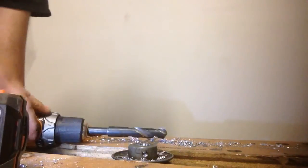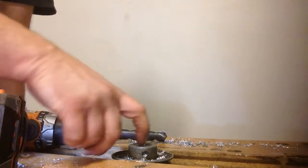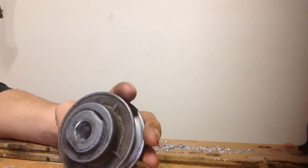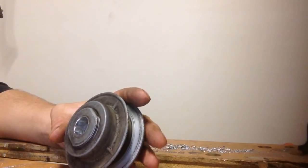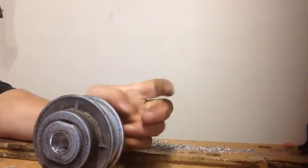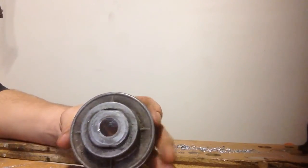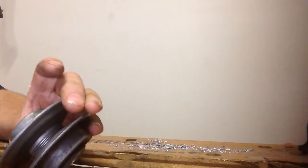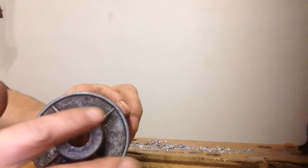I'm going to keep on drilling that through, and I might even go another drill size bigger depending on the shaft. We've drilled up to 11 sixteenths I believe. So our next drill is going to be 3 quarters, and I think that's our shaft size — 3 quarters. So we're almost there, and everything looks nice and straight and even around here.